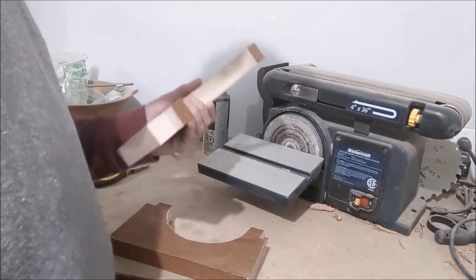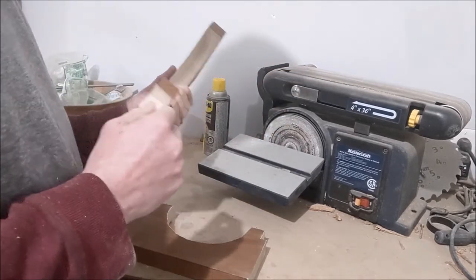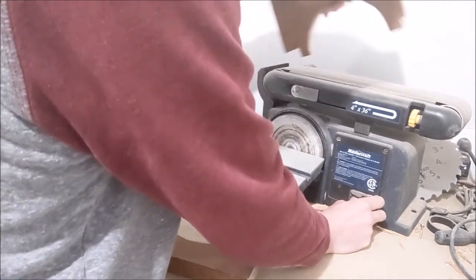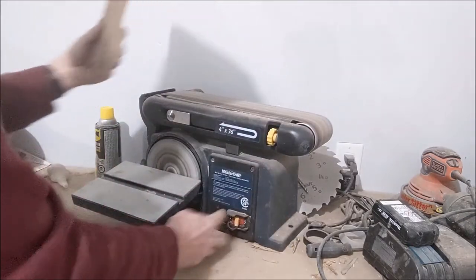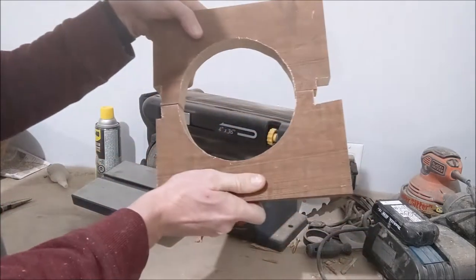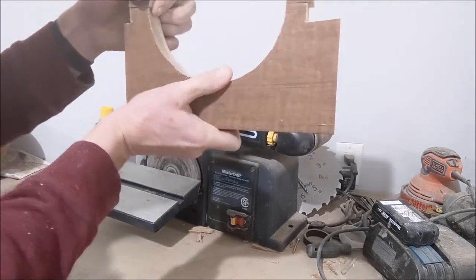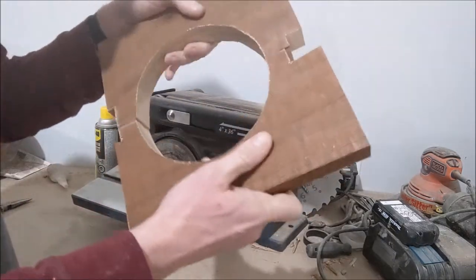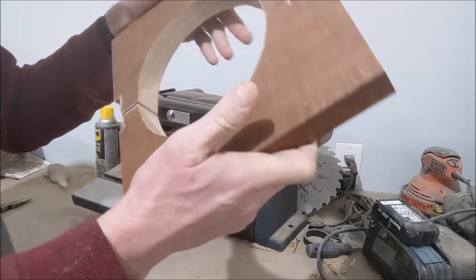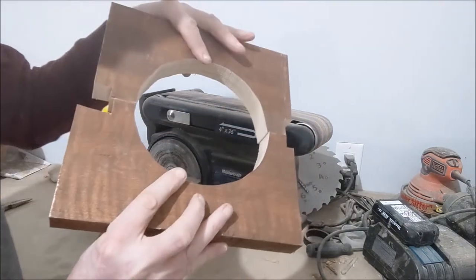This is a little trick for when you're segmenting bowls. If I had a jointer I could have run it through to get a good surface, but I don't. The belt sander does a good job at making two surfaces that mate up well. Now I have two surfaces that mated up very well — I'll be able to glue those together quite nicely. The reason I didn't cut the outside of the circle yet is I just wanted to leave the square edges so that I can clamp it. Once I've clamped this together, then I'll go ahead and cut the outside of the circle as well. I just left it square so I'd have a clamping surface.